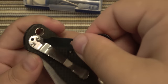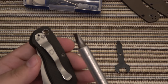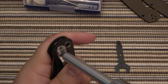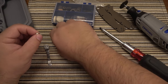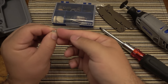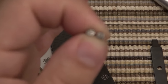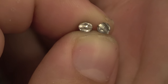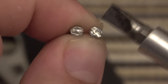It's hard to tell which way is which, but that is turning the screw. Cool — so that's the one screw, I know I can get that out. Let's see this other one. I grabbed a fatter flathead here — let's see if I can get this to break loose. And yes — so there you go, it worked. Let's take a quick peek at these screw heads. Filming this process made the thing a little more difficult. If you put this in a vise and really focus on what you're doing, you can make some pretty precise cuts with your Dremel. I essentially just made a little slit in there — so they're flatheads now.